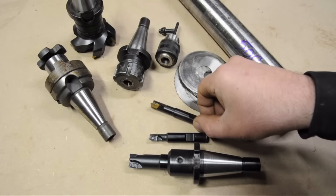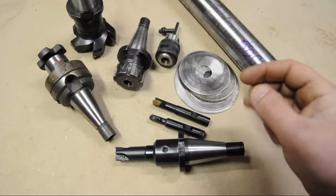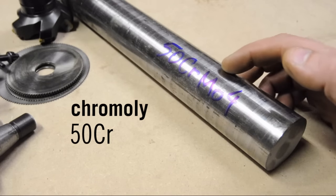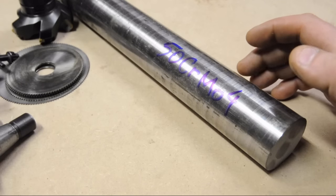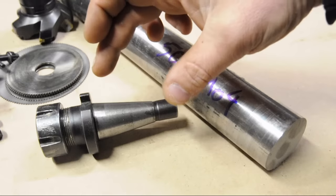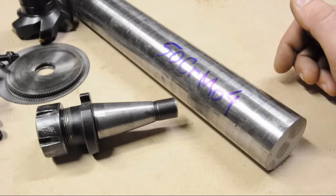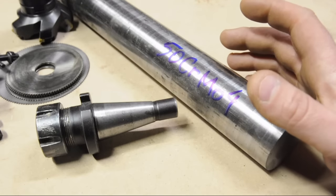I do have one for the larger drill chuck. I'm missing tooling for my slitting saws, and I thought it'd be handy to build permanent end mill holders for my insert end mills. I've already made one — this is for the three-quarter inch. I've got a half inch and a three-eighths that I'd also like to put in dedicated tooling. I've had this piece of chromoly in the racks waiting for that special something, and I think these arbors might be it. This is a 50CrMo4 — I believe that's a 4150. I won't be heat treating this; I could send it out, but unfortunately I don't have any means of grinding after it comes back.